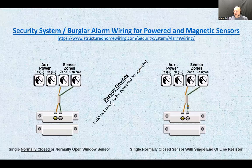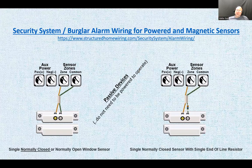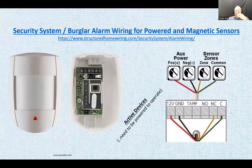What some systems offer is a combination of two, and for that zone or system-wide, you can choose that option in the programming. Anytime you change something like this, you're going to have to let the system know. If you connect this here and that here to the same zone, you can trick the system into treating it as two zones. So you can make 16 zones out of an 8-zone panel. Some systems have that capability, some don't. I always try to avoid that kind of solution. If I needed more zones, I would just get an expansion board. But something like that exists.